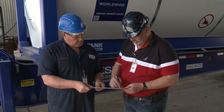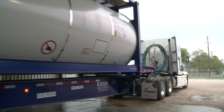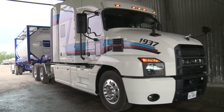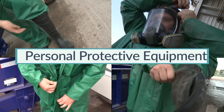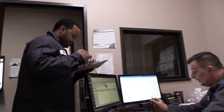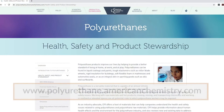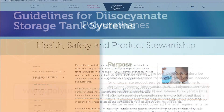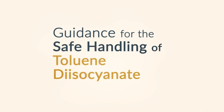Sign the delivery report and note any unusual problems or delays that might have occurred. After removing the barricades and wheel chocks, the tank container can be released. In this section, we have discussed guidance for safely unloading toluene diisocyanate from bottom unloading tank containers, including preparation for unloading, documentation, regulatory information, pre-unloading, personal protective equipment, connecting, transfer operations, disconnecting, and preparation for return. If you have any further questions or are unsure of the actions required of you, ask your supervisor or team leader or contact the product manufacturer. For more information, consult sources including literature developed by the Center for the Polyurethanes Industry: Guidelines for Diisocyanate Storage Tank Systems, and Guidelines for Receiving and Unloading TDI.